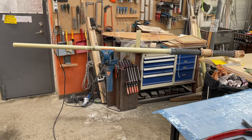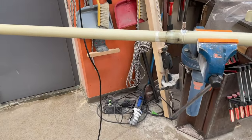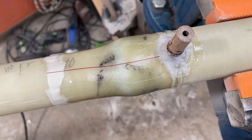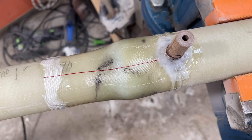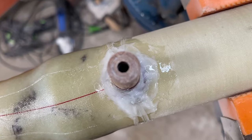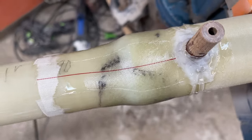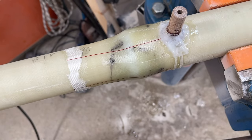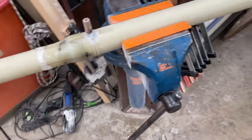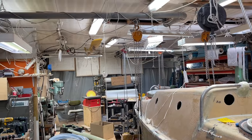So now, the nipple is here. The GAP is closed. The glass fiber and peel ply and sikaflex and epoxy. And I'm going to put some injection here. So let it dry. And then tomorrow, we'll see how far up it goes in the roof.